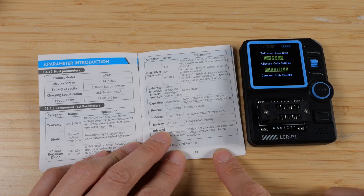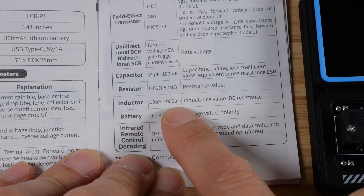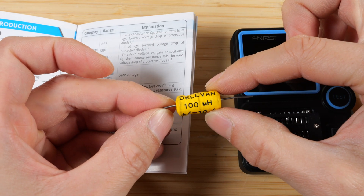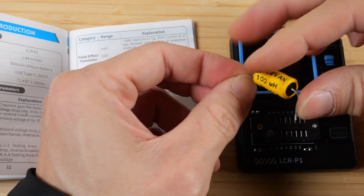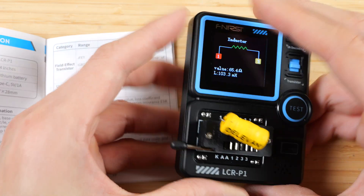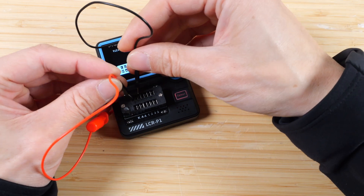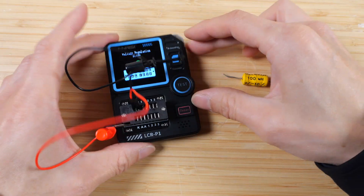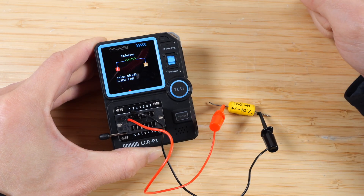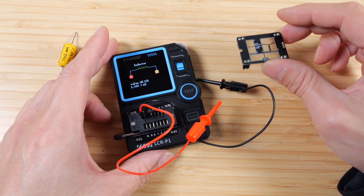This is not going to measure everything you can toss at it. For example, the inductor can only measure up to 1000 microhenries — that's 1 millihenry. I have a really large 100 millihenry inductor here. Even if I bend the leads and try to fit it in, it can actually do it after all — though your mileage may vary. If your component is a little bit too big, you can also use the test leads, close them on there, and connect to the large inductor. Push test and it still measures it as an inductor: 103.7 millihenries. Using the leads to press on is a little annoying and hard to get good contact, but they're much more handy for large components.